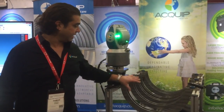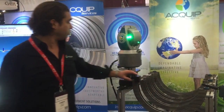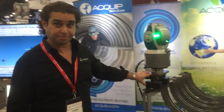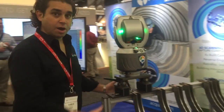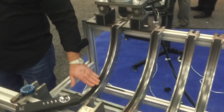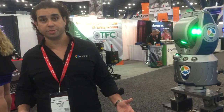We have an internal alignment steam turbine simulator here and we have the Faro Vantage laser tracker. It's set up on our Maggie bracket. Right now we have it just set on the side of the simulator, but this is a curved surface magnetic bracket and we can also set it inside of the unit if we want to, like we generally would if we were setting up in a real turbine.